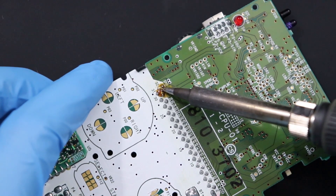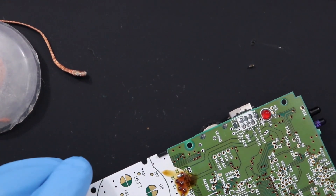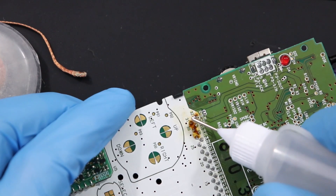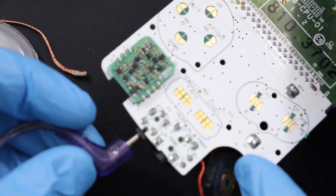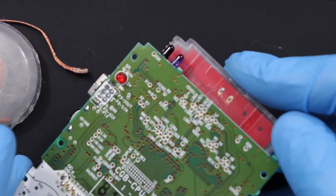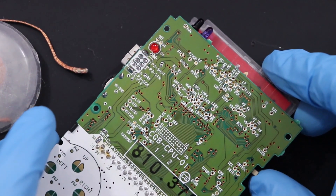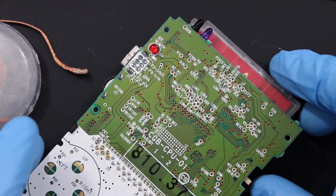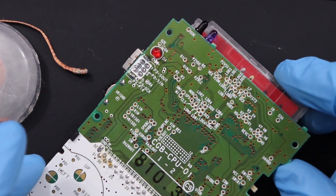Amazingly, I would have a perfectly running Game Boy Color board if it wasn't for just one problem: the board won't seem to boot any game cartridges, and will shut off almost immediately with them inserted in the cartridge slot. I suspected that what I thought was a blob of solder bridging the ground and reset pins on the cart slot was the cause of this problem. However, that ended up being a capacitor, and it's there for a very good reason. It slightly delays the reset line at CPU start-up, and it was likely installed by Nintendo's service center. It was common for some early Game Boy Colors to have problems booting games on the first try, which this capacitor is intended to help fix. Needless to say, it ended up not being the problem, and the board still won't run any games.